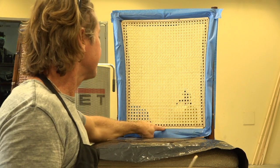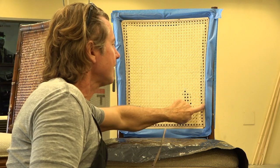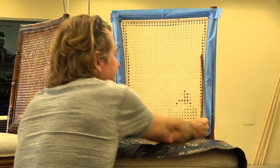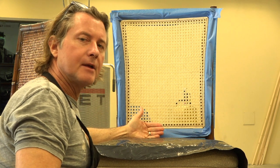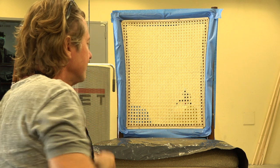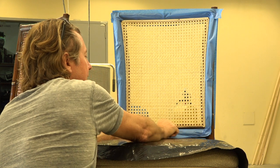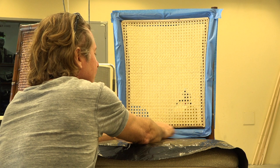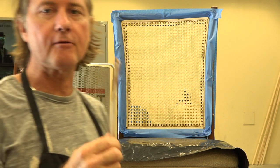The reason that I put those on is once I affix these pieces of trim on there, this was up a little bit higher here. It's nice and level, and when I seat these pieces on, it's going to be nice and level like that. But right at about this point here and this point up here, they were kind of sunken in, maybe, I don't know, an eighth of an inch. So I put the strips in here. You can see them. I glued them and tacked them in with the staple gun. And that'll allow this piece of trim to be even with this side and give it a nice solid surface to grip to right here. So when I glue and pin those on, I'll go over more of that later when I show you how to apply these.